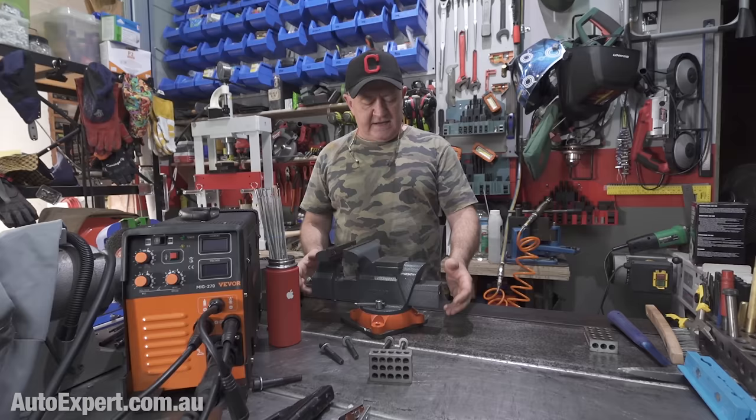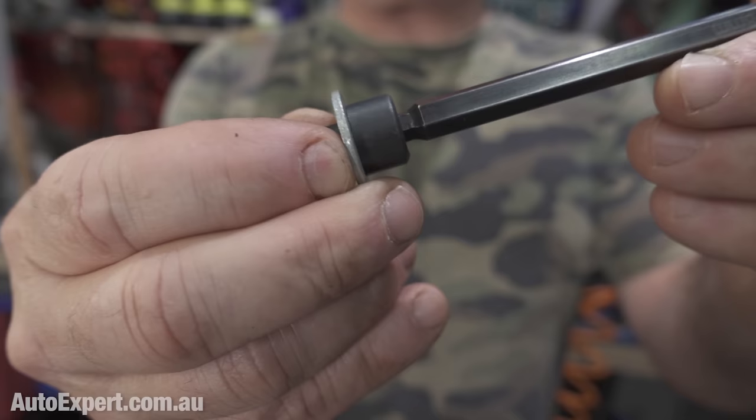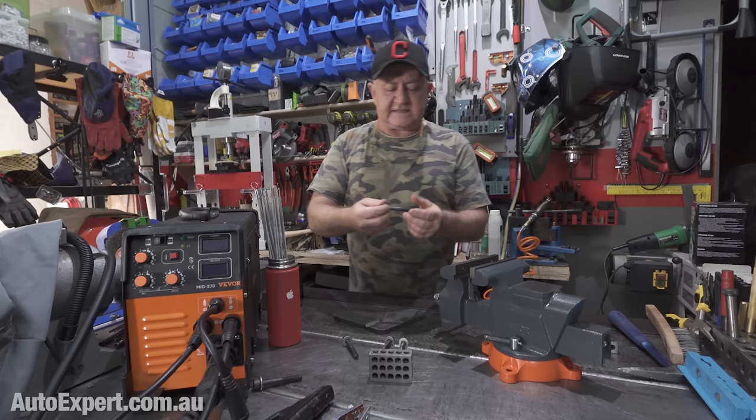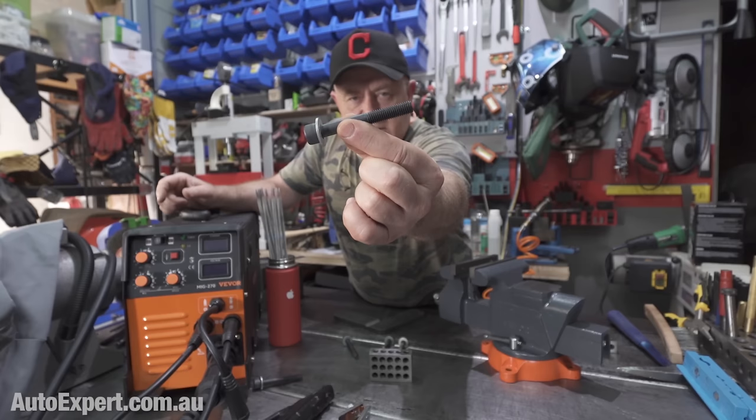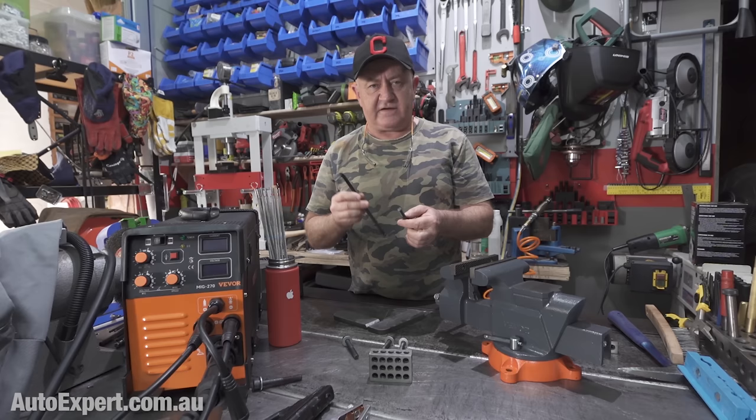It's also not going to over-compress the edge of the bench, because the nut and washer won't just suck themselves into the wood and destroy it. I've got these M10 by 1.5 — the standard metric thread socket head cap screws. There's about an inch and a half or 38 millimetres of bench top, and there's a washer to go on top of the vice. It's going to screw straight down into the bracket. The cap screw is just a round head that takes an Allen key — for M10, that's always an 8mm Allen key. The 1.5 tells you there's 1.5 millimetres between adjacent peaks or troughs on the thread profile.